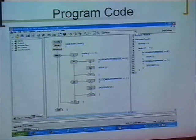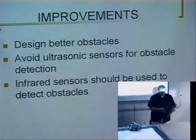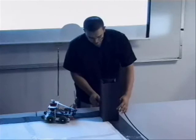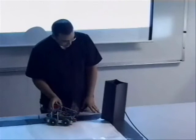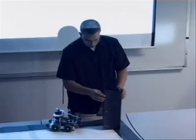In the destroy mode, it keeps homing in on the object and getting closer until it gets in range to knock it down. One of the problems we had was that for the ultrasonic sensor to read perfectly, if your object is flat, it needs to be positioned normal to the sensor — the signal needs to go and bounce directly back into the sensor. However, if the object is flat and you rotate it, the sensor can no longer read it. In order to combat that, we decided to make objects that were concave so that it would give us more freedom to detect obstacles at different positions.